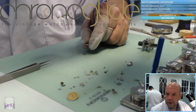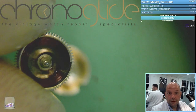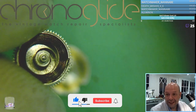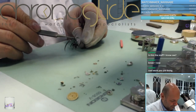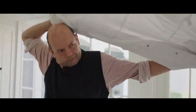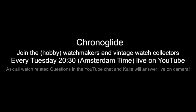Look at the state of the mainspring — it looks good, looks very good, all shiny and new. I have to take it out anyway to see, because it's old material. We do need another mainspring because all the strength is gone from this one.